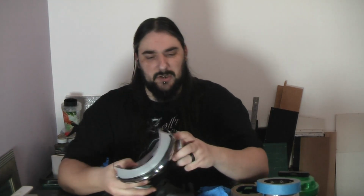Especially if you're spray painting or using epoxies on a regular basis, it makes sense to have them. The mask you can reuse for everything, even the one I just threw over there. You can just buy separate filters that go on them and have different abilities. So if you like the mask you have, go online, find out the make and model and order replacement filters. You can literally just screw them off, screw them back on, done.